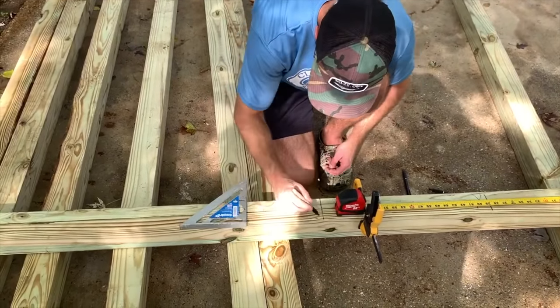Now what I'm showing here is there were a few air bubbles that formed near the front entrance of the shed, and to get rid of those I used a blowtorch and I brought the heat within a reasonable distance to those air bubbles, causing them to pop. You can achieve a similar result with a heat gun. Now here's a quick look at the epoxy floor 48 hours after applying our epoxy.